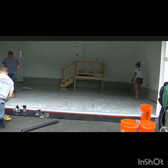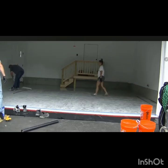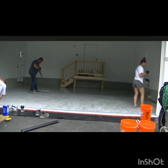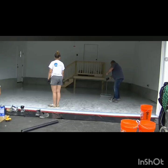And then we try not to mix all the kits in one shot, because epoxy will dry in 20 minutes and then you have to finish it in 20 minutes. Otherwise you have to just throw it away and it will be a cost for you. But anyway, we just mix part by part, maybe half a kit, finish it, and then come and mix another half.